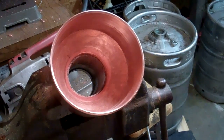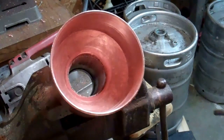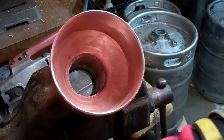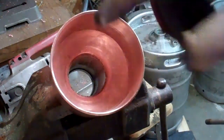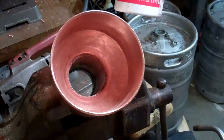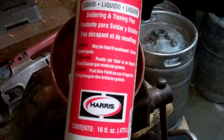I'm going to show you how to make your solder joins on your copper. First thing — which I've already done — is go in there with your sandpaper and clean the inside out real good. Whatever two faces are going to join, sand them and clean them good.